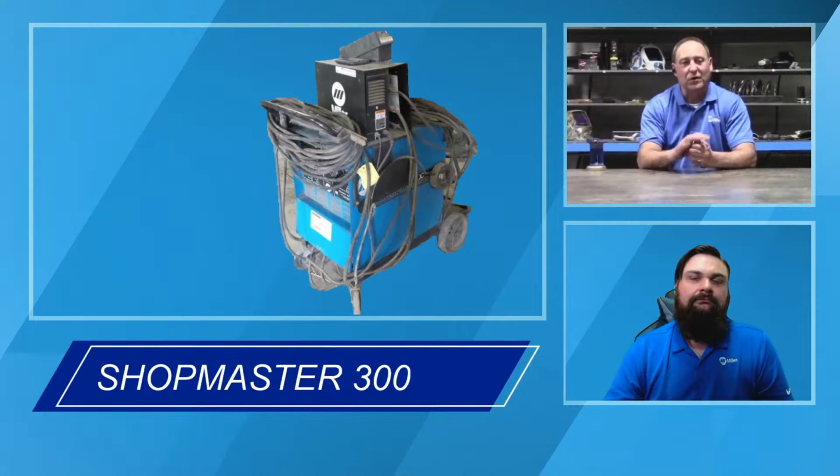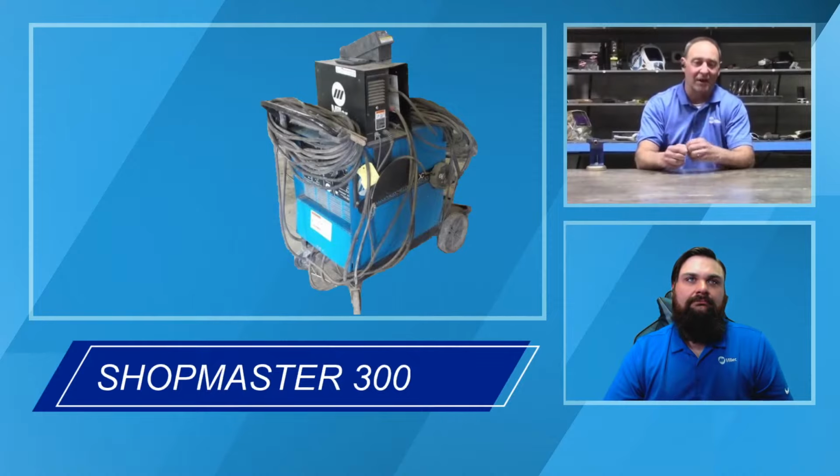And the other thing is that looking at that picture, you see there's a whole lot of stuff going on right there. You got a welding machine, you got cables. That's an HF box on top of the machine if they wanted to TIG weld. If you wanted to MIG weld, you had to go and buy an external MIG welder. So there's a lot of cables, a lot of things going on. Matter of fact, when I was in the field and we'd have to go on Shopmaster calls, a lot of times what we would do is we'd bring along colored electrical tape, so that way we would color code the cables and the output studs for the different processes. So when people would have to switch processes, they knew what cables and what connectors on the machine they had to hook it up to.